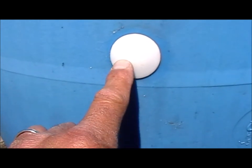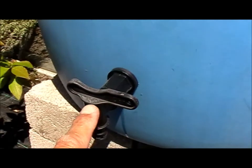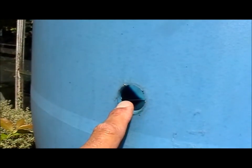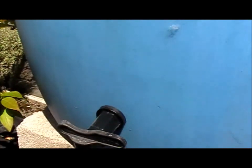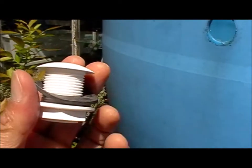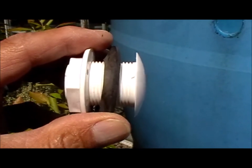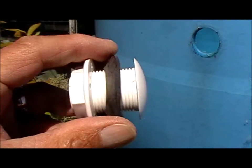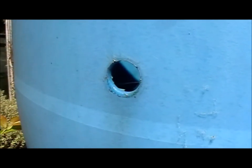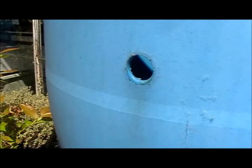It's not big enough in diameter. So here's the other one - I moved this tap yesterday and there's the original hole. It's 25 millimetre, or an imperial inch thereabouts. The challenge was to find something to stop that, and I'm going to use this - it's an overflow stopper and this thread here is an inch. There was surprisingly little information on the internet; some people were plastic welding over it and stuff like that.